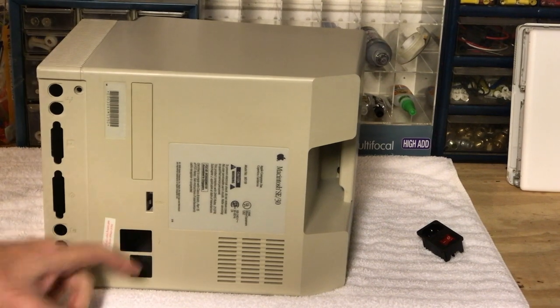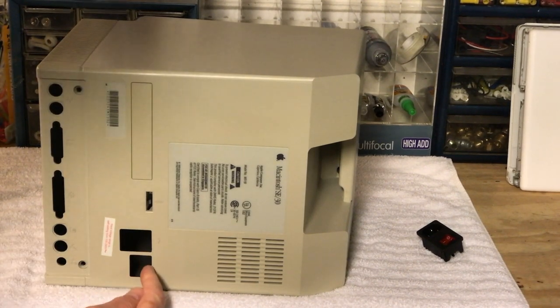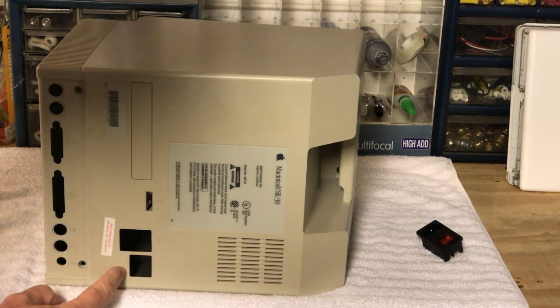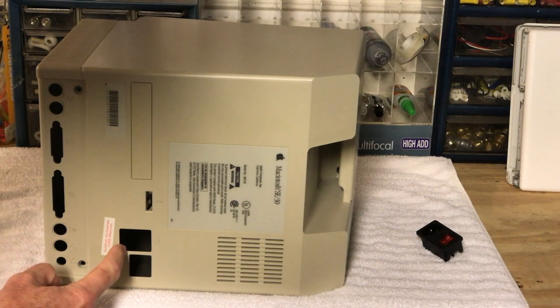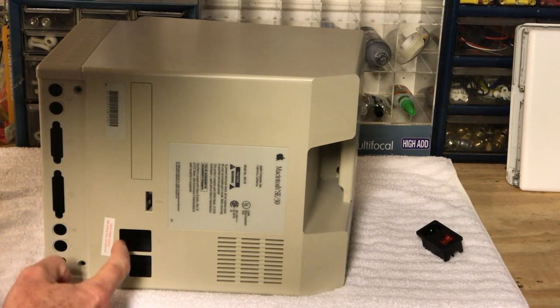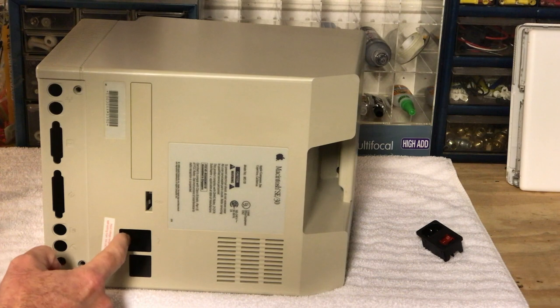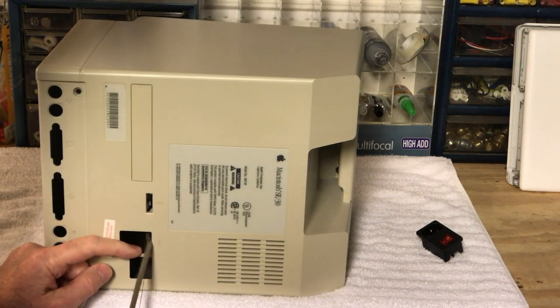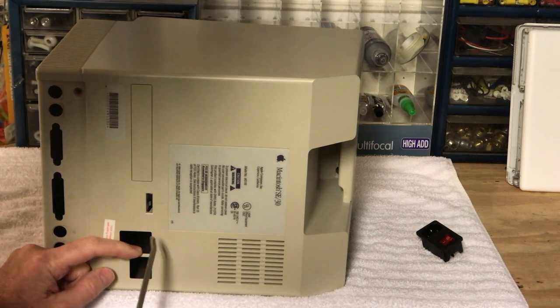What I'm going to do is cut this piece out here, take measurements, elongate this hole a bit, and there's only this one piece we need to do a little fill on, which won't be too bad. I'm going to use this little modeling file here to work on it.